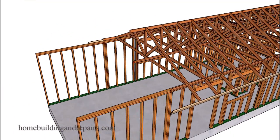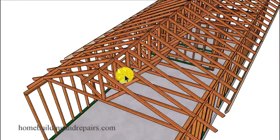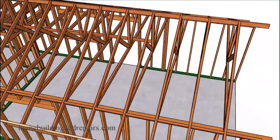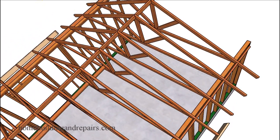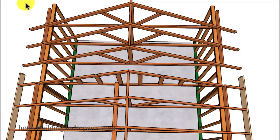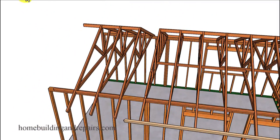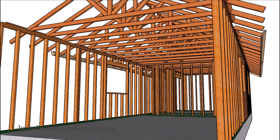You can remove the truss and install new trusses that would be designed similar to the old ones so that the roof and the ceiling would match. You can see here where the old wall was and where the new trusses have been installed. This situation right here will not work — or should I say it could end up sagging over time or damaging the drywall or plastered ceiling.